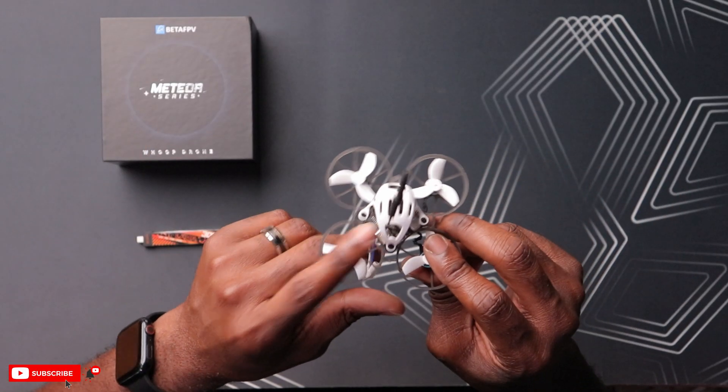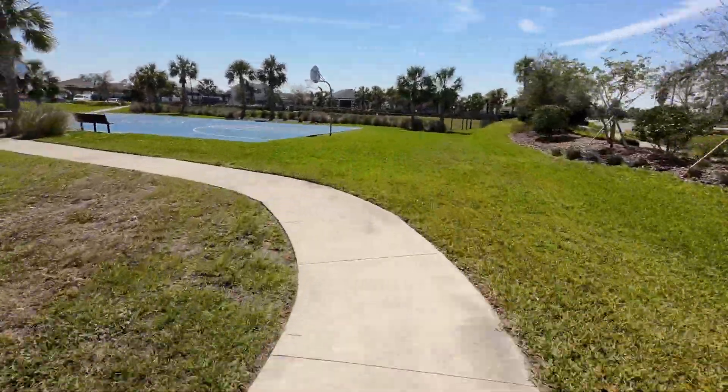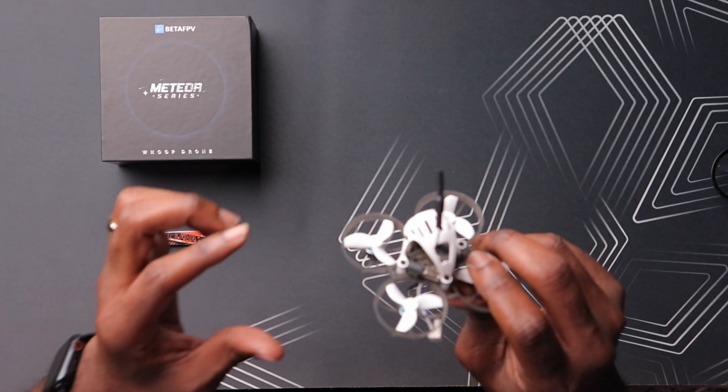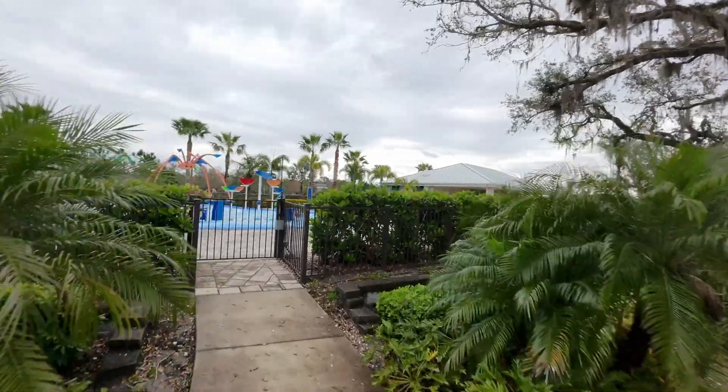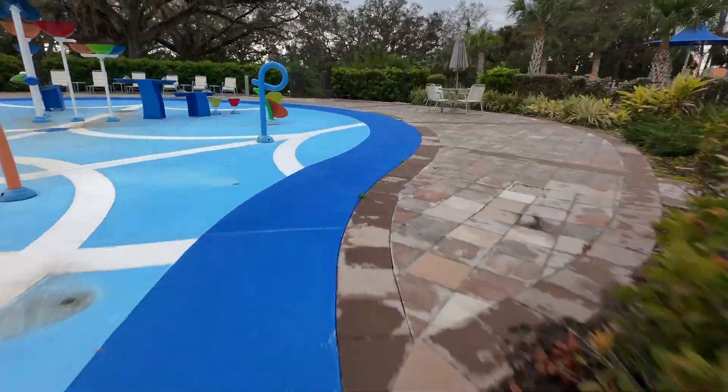Flying this drone, I flew it around 3.3 to 3.2 volts — I never wanted to have an issue with the VTX powering down or browning out. That leads us to image quality of the O4, and this thing was really good — surprisingly really good. I did use this camera on another drone, the Pavo Femto, and although the image was clear, I had some vibrations and jello with the Femto. We're using the same dampened mount system here, and I was wondering if that would transfer over to the Meteor 65. But it was amazing — it was smooth. This is a very sharp image, kind of washed out, with high contrast and high saturation. But you can dial it back in the goggles if you want to, and I'd highly suggest that. We're still working on ND filters for motion blur in cinematics, but overall the image on this is spectacular.